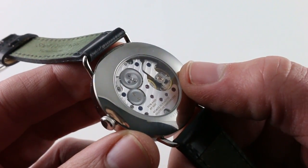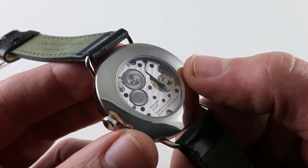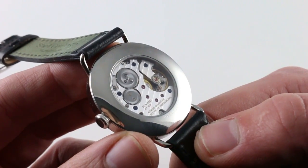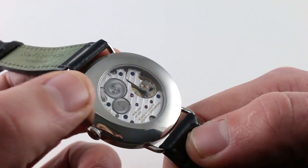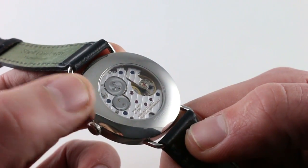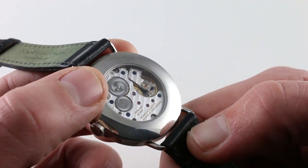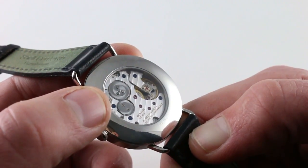What's highly unconventional is that a company outside of the Swatch Group, Rolex, Seiko, and a handful of specialists has managed to create a full escapement, hairspring and balance. Now, you'll note the crown wheel and the ratchet wheel are among the few truly hand-finished components of the movement. There's actually a gentleman who does this work over and over and over again, and those wheels are hand-finished to create that unique double spiral pattern.